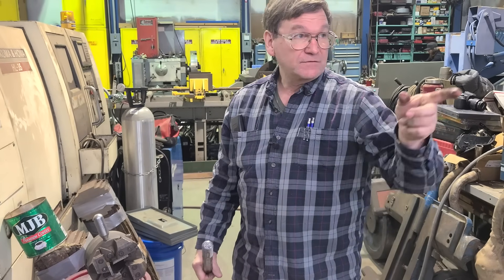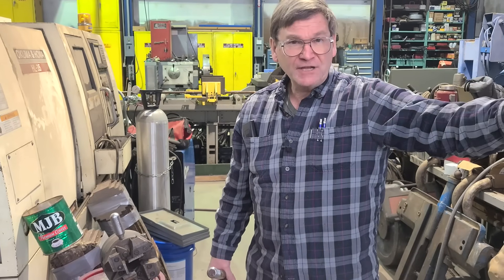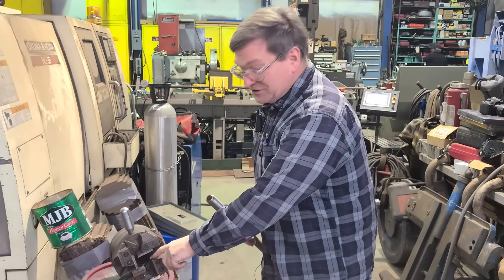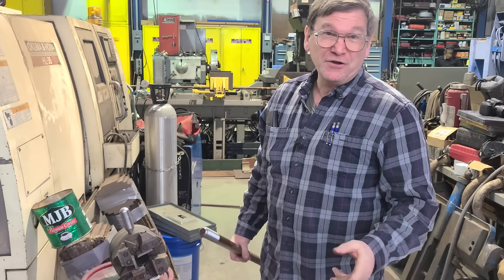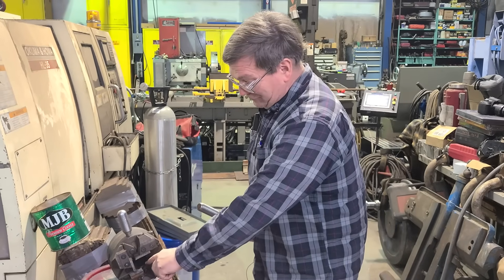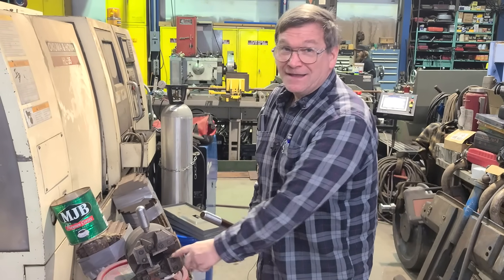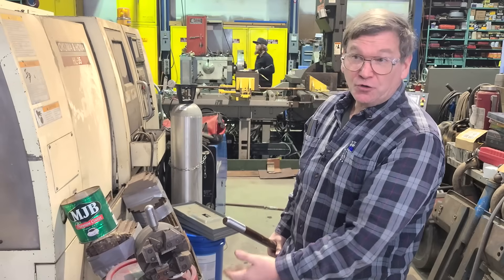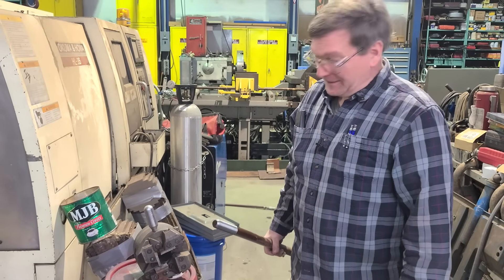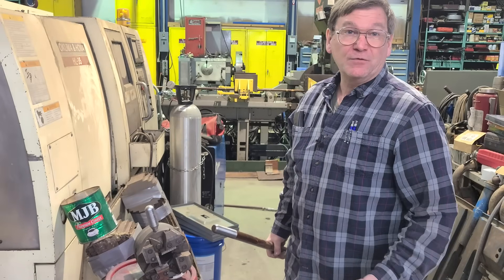Like the geometrics where you can sharpen those on your carbide tooling grinder or a surface grinder, these ones you literally sharpen by hand. They make a fixture for it, but most shops that run these just go over to the bench grinder and sharpen it. As long as this part is lower than this part — if you go too low, it'll still work fine; if you don't go low enough, you just go lower. The only problem with going lower is you wear out your dies quicker.